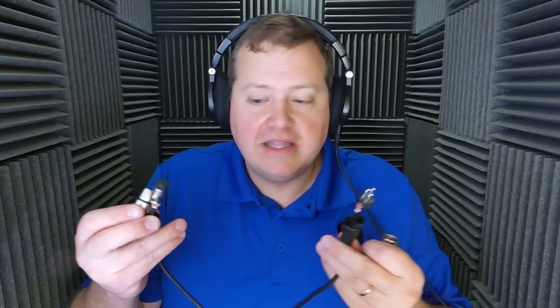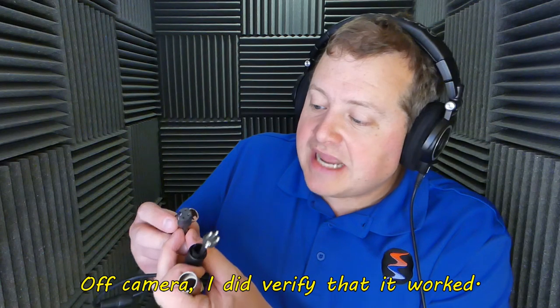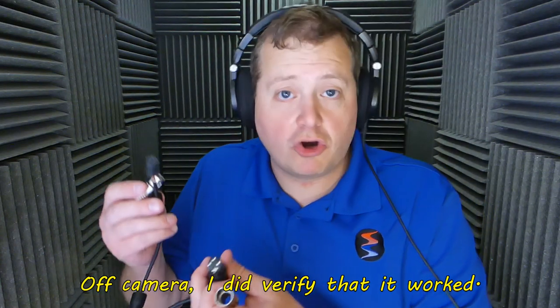The short cable it comes with does not impress me. I guess it's kind of cool that the cable wrap has the brand labeled on it, but the pigtail itself is thin XLR, not branded. The connectors are a kind of imitation Neutrik type, also unbranded. That said, after taking them apart, nothing really throws any red flags — the solders look very clean, the ground is tied to the casing on both ends. The cable is just a standard cheapish type, not StarQuad or anything, but I might give it a try in something like a Zeppelin.